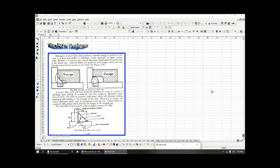Likewise on the concave, you may have penetration, but you don't have strength in the weld itself. You're just over melting the base metal, and then you don't really have the full throat of the weld because of over penetration and it became concave. The ideal weld, in the bottom, is slightly convex, has the maximum throat on it without being very bulgy. You have equal legs vertically and horizontally, and a good amount of penetration. You don't need a lot of penetration, but it should be penetrating enough that everything is fused together between the base plate and the vertical plate, more or less as shown in the diagram.